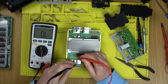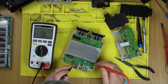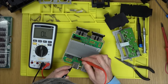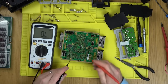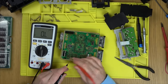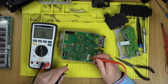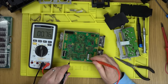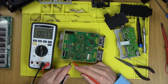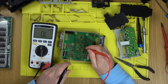I'm going one side to the other side of the capacitors checking for shorts. If my meter beeps I'll then put it into ohms to confirm. For example, you can see that's 31 ohms — it's beeping there but that cap isn't shorted because on the ground side it's less than 1 ohm, and on the other side it's 31 ohms. So that's definitely not a short. It's just nice sometimes to do this without having to look at the meter constantly.